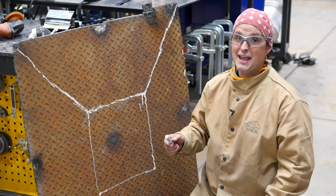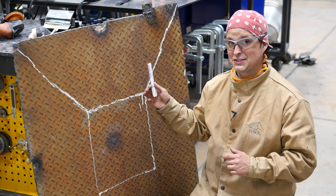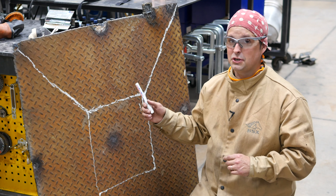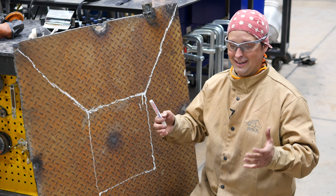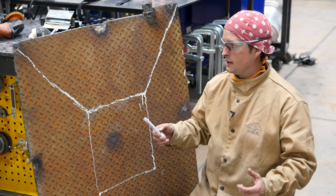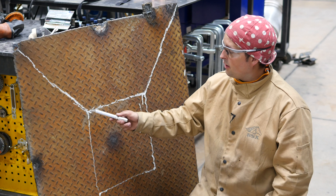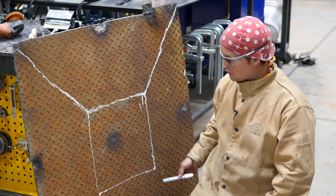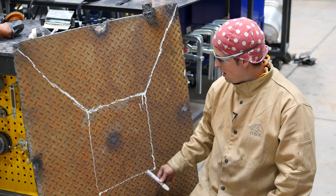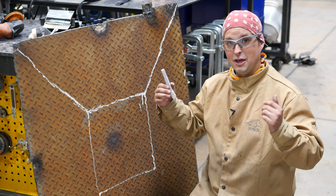The project that we're doing is a fire pit. I don't have any special tools or anything like that. I've got this scrap 3/16 inch material and just with an angle grinder, we're going to try to make a nice little bowl for our wood to sit in. I've got a basic design here — I'm going to make a cut here and a cut here, and this will be the bottom of our pan where the wood's going to sit. Then we're going to fold these all up and weld them together.